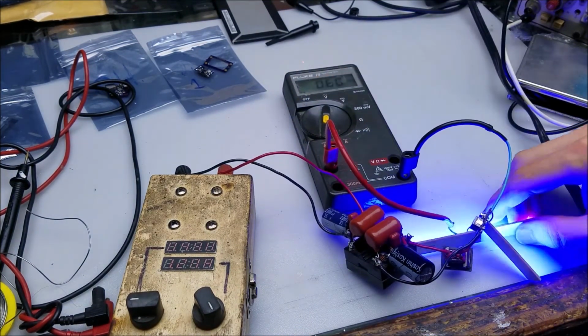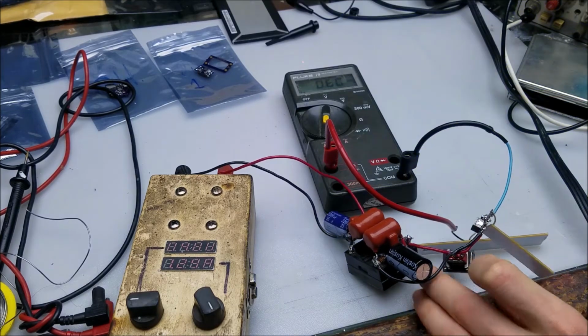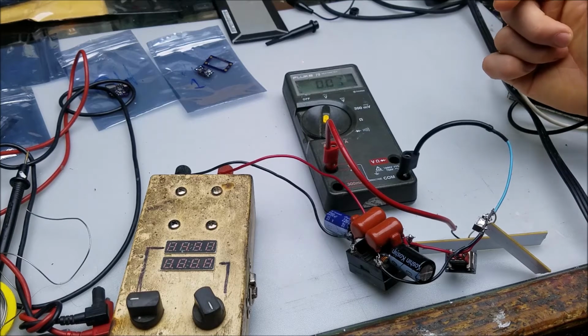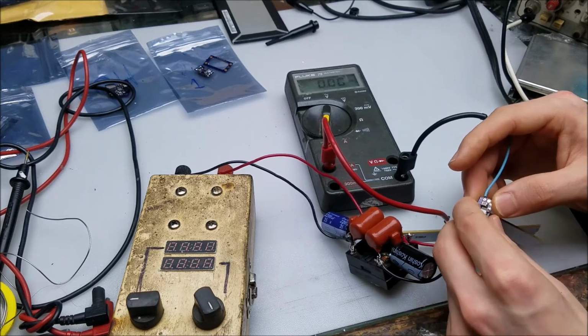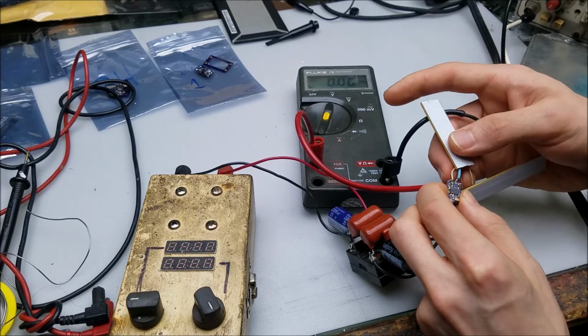So let's reduce the size of the shunt resistor. So bring it from the 320 milliohm range to 160. So I'm going to remove one of the shunt resistors, which should give us about 1.2 amps on the output. Go ahead and test that. See how well it holds.